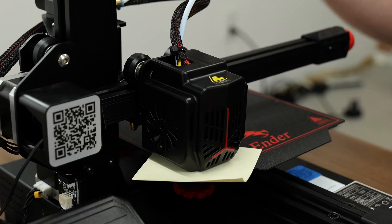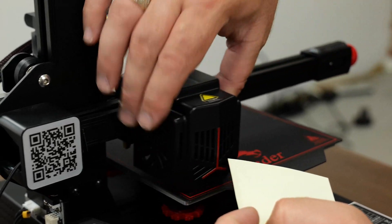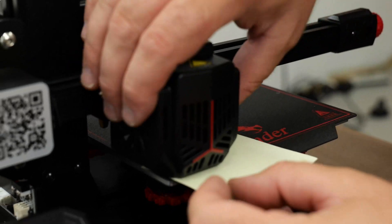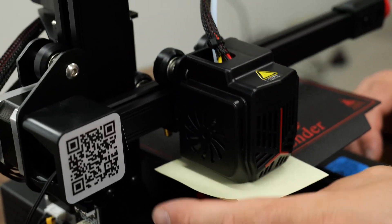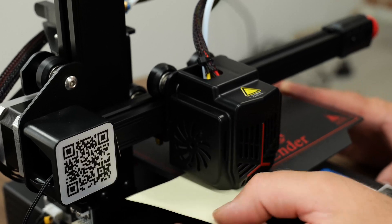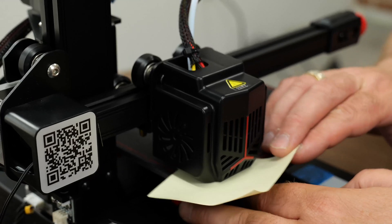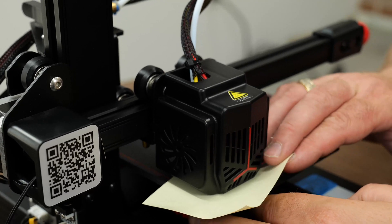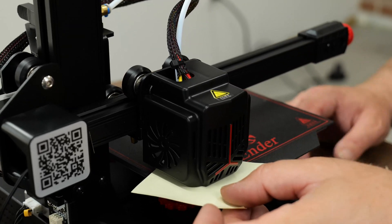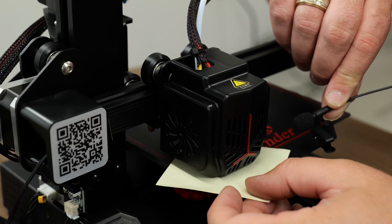All you want to do is go around to all four corners. You home the machine and then disable the steppers — that gives you the ability to move the head around and the bed back and forth so you can go through the bed leveling procedure. We'll start at the first corner here and get that under there. It's a little tight — the paper's too tight, so we'll loosen that spring up by turning counterclockwise. The filament won't stick when the paper's too loose, so I'll go ahead and turn it slowly clockwise, moving the paper back and forth until I've got just a little bit of drag where it just scratches.